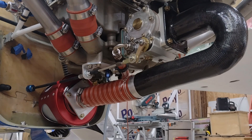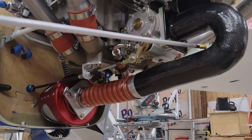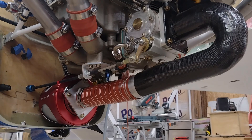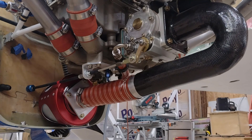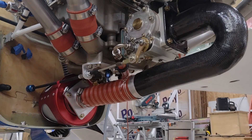I tried a number of different machinations and had to make this a little bit tighter than I wanted as far as diameter. Two inches is what the Airflow Performance guys have; I think I have about 1.85 inches, so I cheated a little bit there — but I have the same inside diameter and the same airflow. I had to go at a slight angle up to get the whole unit off the bottom of the cowling. It's about 280 thousandths off the bottom of the cowling, just a hair over a quarter of an inch.